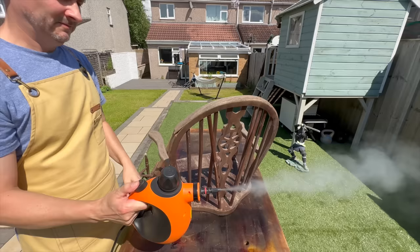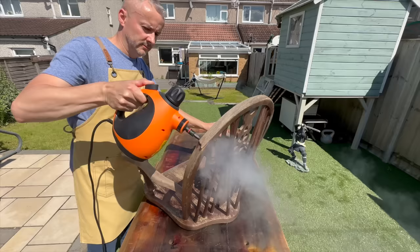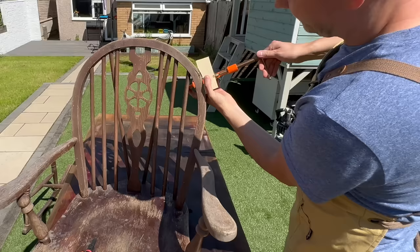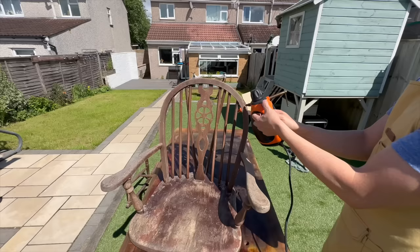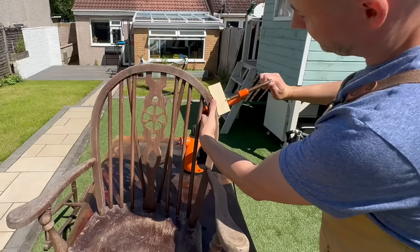Because this wood was very dry and I didn't want it to crack, I gave it a really good soak and used my steamer to make it more flexible. Because I wasn't sure how much it would actually bend - since I don't have a proper steamer - I clamped it not all the way and then used my steamer again before clamping it all the way down. I basically left it to dry hoping that it would bend into the shape I needed before I would actually glue it.